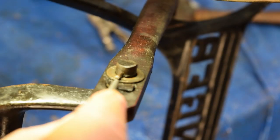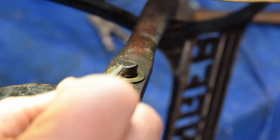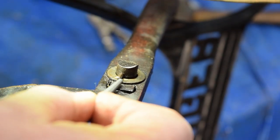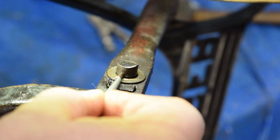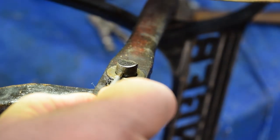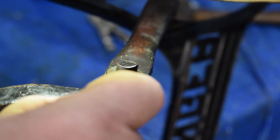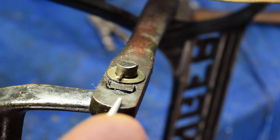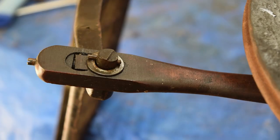Okay, I hope you can see this pin right here. It actually goes through this shaft, and it's got to go back out in this direction. This thing has been in here for 115 years, and it really doesn't care very much about some fat guy from Georgia. But I've been very gently tapping it with this nail set that happens to fit it perfectly, and I've got it to move. So I'm going to swing you around to the other side, see if I can tap and pull this pin out. Remember, this pitman arm is wood. We can't use heat on this. Okay, here we go.